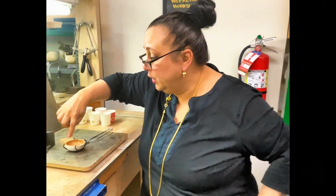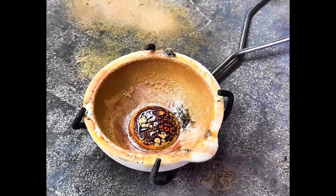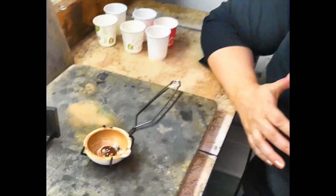And what happens is this. As your crucible gets used and used, some of the borax on the side starts to kind of travel down. And remember, very important — when you prepare one of these crucibles, you don't want a whole bunch of borax in there. I'm not one of those people that's like, add a little more every time, because then you're just going to get a giant puddle in there. When it all starts to climb down there and cover your gold, if there's too much of it, it basically forms this puddle and it will become impossible for your gold to be liquid.